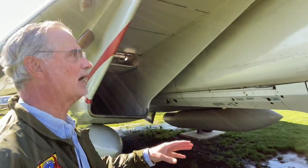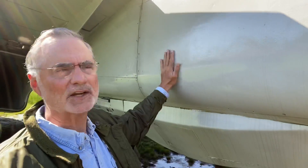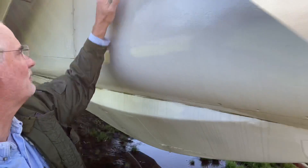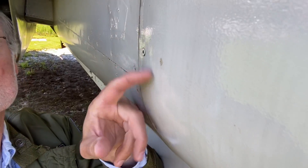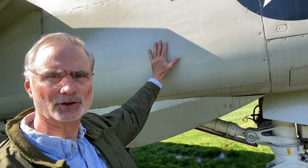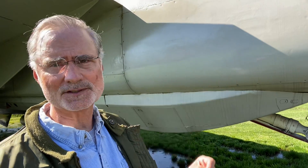First thing you do is come up to the starboard side and just start tapping on the panels to make sure all of these fittings are intact. You can see on this one, this Calfax is loose — we'd have to get a maintainer over here with the appropriate wrench to manually tighten it. That's why the F-14 was retired when it was, because it was a bear to maintain. To access this panel, you'd have to take off or loosen every one of these Calfax, and they're not all the same size. Very labor intensive.